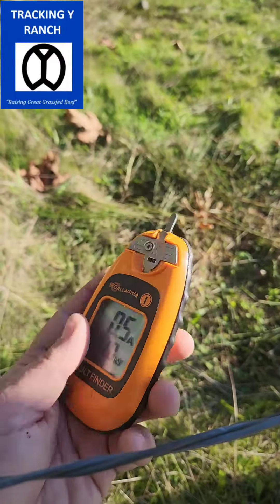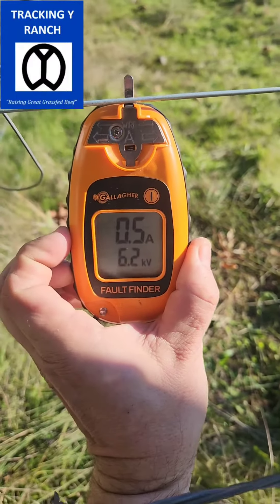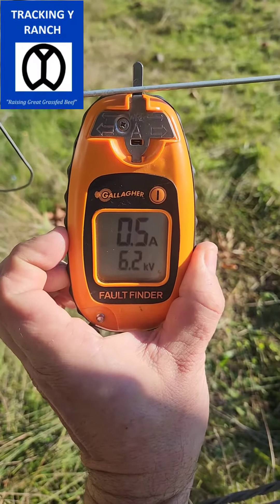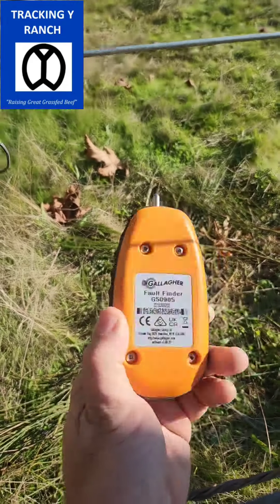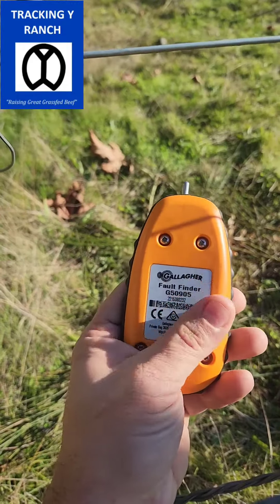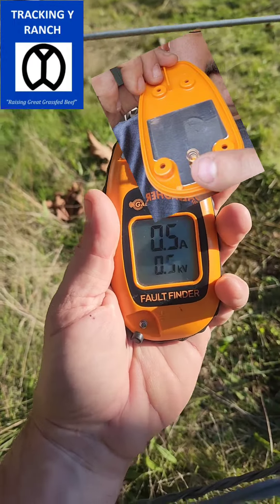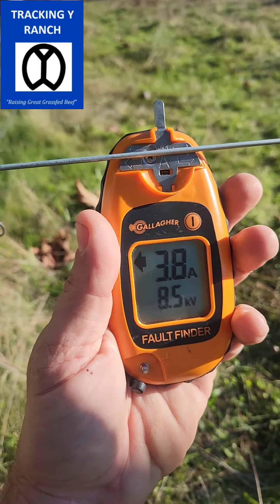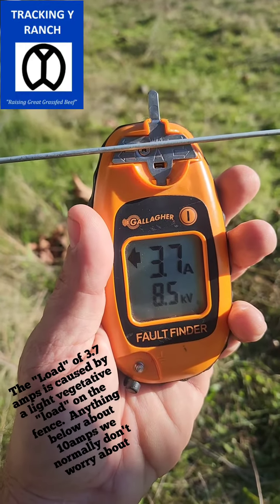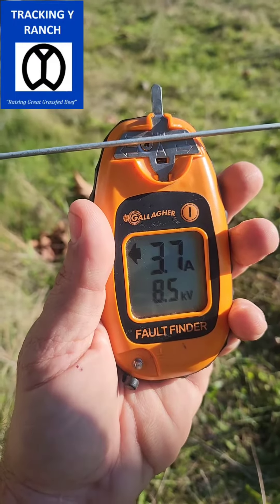So we're not even touching anything. The main thing I want to show you is I'm going to grab hold of this fence tester on the outside. You can see we're at 6.2 kilovolts. There is a metal plate on the back of this that helps to ground this out. We're going to hold it like you would normally hold it and touch it. There you go — you can see now we went to 8.5 kilovolts, so it's now conducting through our body a little bit.